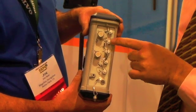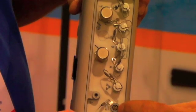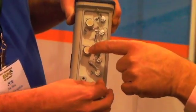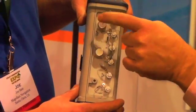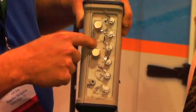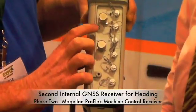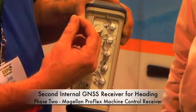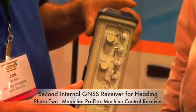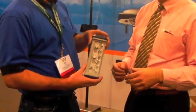There's the CAN bus connector port, then three serial ports, an ethernet port, and a power port — this is the port that charges the battery or runs the device. There's also a satellite antenna, a radio antenna, and an earth ground. And there's a hole here for phase two of this product, which will have heading — we'll put another GNSS port in there to run two antennas and give real-time heading, so centimeter position plus heading.